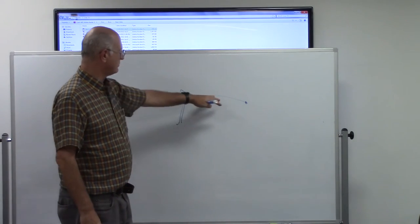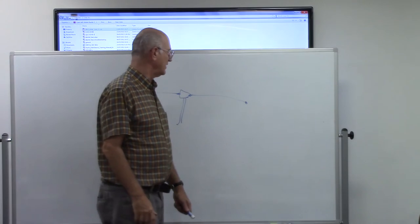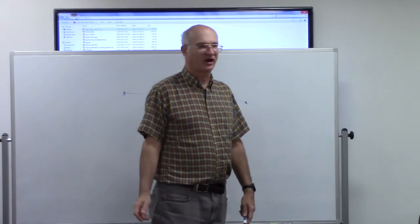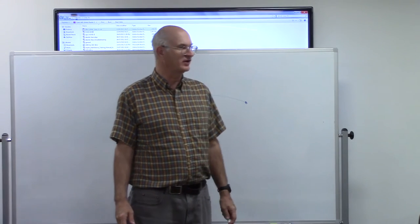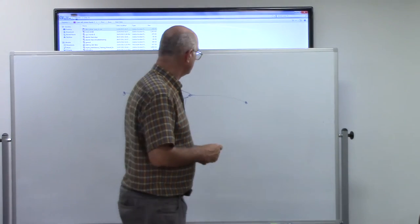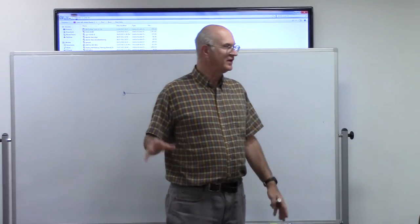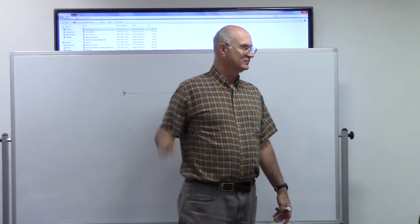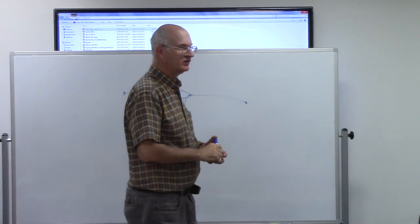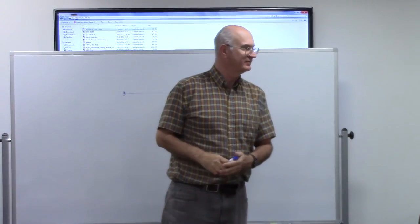And if somebody happens to grab your antenna system because they thought it would be cool to grab it, they can get a nasty shock, and they also can get very serious RF burns. Radio frequency energy will really give a nasty burn. So you want to keep these high enough and away so nobody can get up there and grab them. And keep them 15, 20 feet minimum so kids can't get and think it'd be cool to touch them.